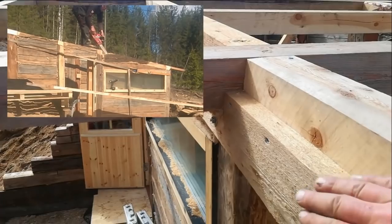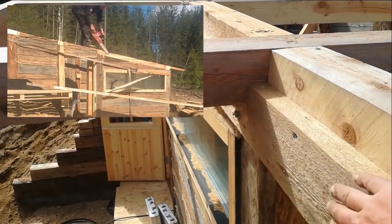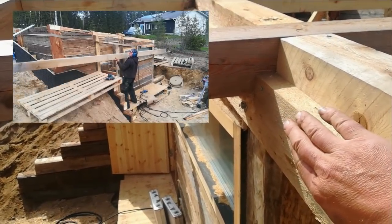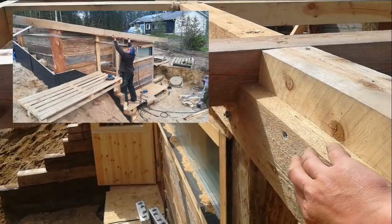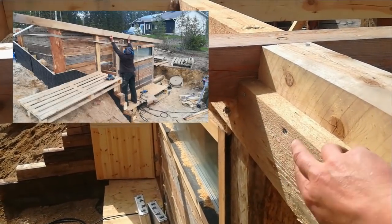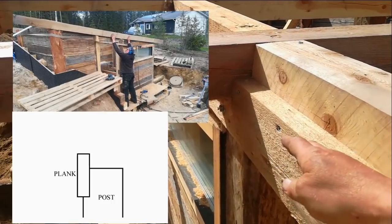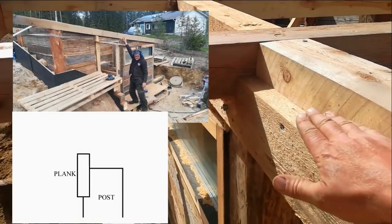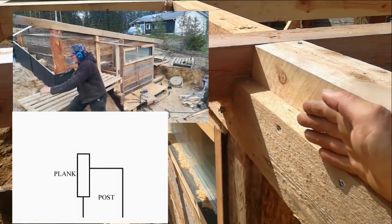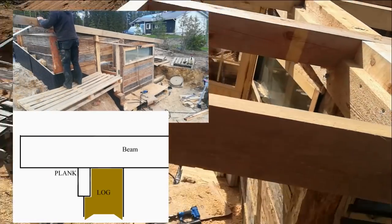And it's effectively sunk into the side of the wall, so it's sunk into the posts and into the horizontal logs, but it's only attached to the posts, and it actually goes 10 centimeters down below the level of where we cut the wall, and there's insulation trapped in between, and that means that as the wall section drops, I get a better angle.